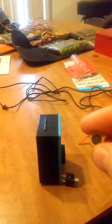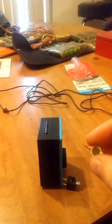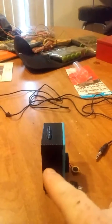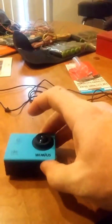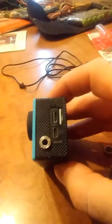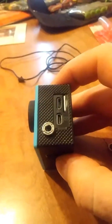The speaker that was in there actually sounded pretty good — it had two wires, positive and negative. I just snipped the wires, soldered on new wires, and ran them between the circuit board and the battery case inside. They barely fit, but I got them over to the other side, and as you can see, the finished product — the mic jack is installed right there.